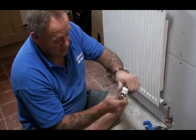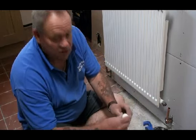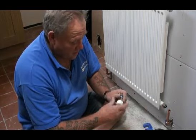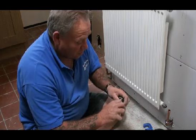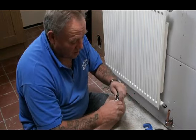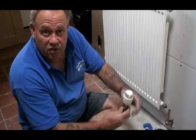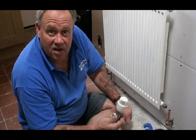That operates as a thermostat on setting zero and then you know for a fact that that valve is fully closed. You can take the radiator off with no danger of letting water through the system when the room calls for more heat. So that's how a thermostatic radiator valve works — look for one with a replacement cap, look for one that goes all the way down to zero, and then use this belt and braces approach. You can be absolutely sure that if you need to turn your radiator off for any reason, you're not going to let any water through when the room calls for more heat.